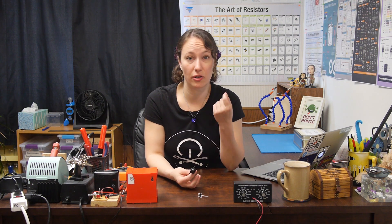We'll run the power to our buzzer first through a transistor. This will make it so that rather than the volume of the buzzer being more analog — turning up and down depending on the amount of light the photoresistor is sensing — it'll be more digital, turning on and off. When choosing a supply voltage, I need to remember to factor in the voltage drop across the transistor. So if that's 0.7 volts, I don't want to choose the minimum 3 volts the buzzer could take, because that means it would only get 2.3 volts after the voltage drop. So I need to choose a higher voltage.